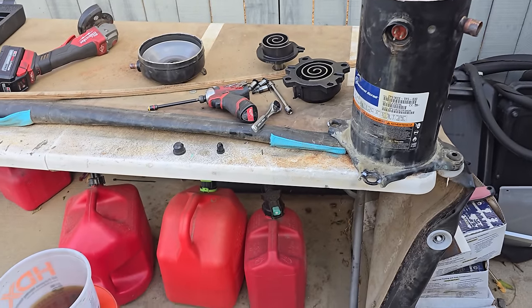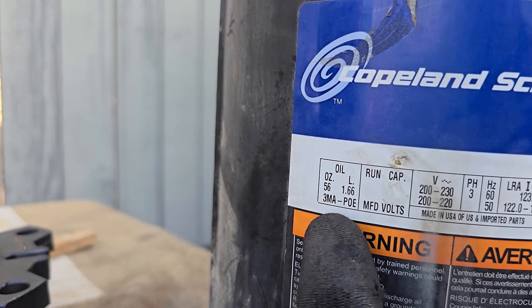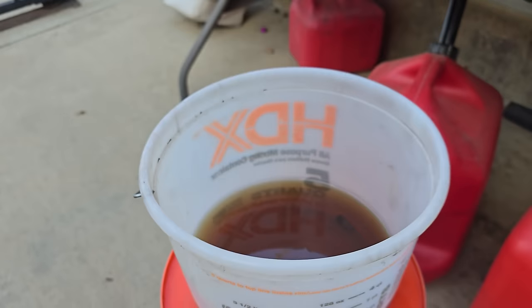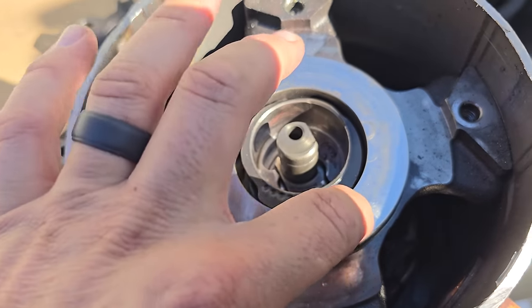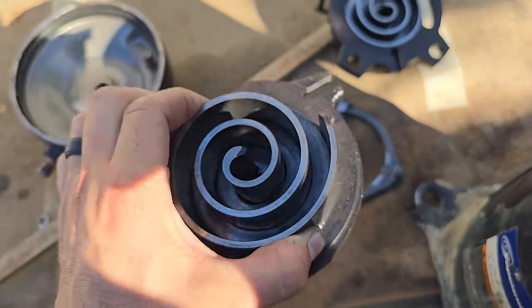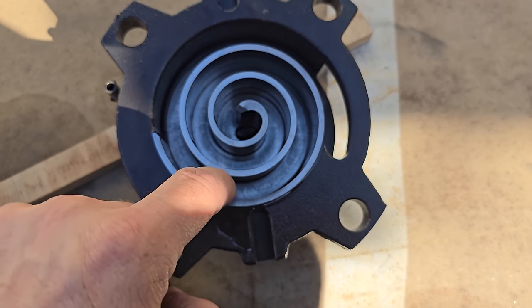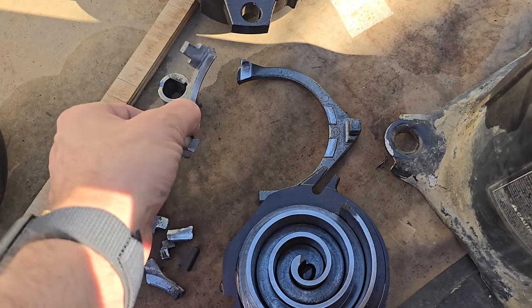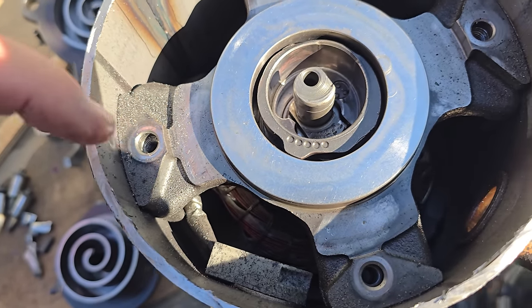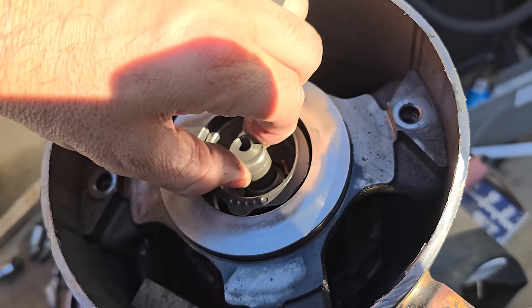I don't advise taking a grinder and cutting and shooting sparks when you have gas cans around — of course, I've moved them out of the way. Let's look at this oil charge: 56 ounces, pretty darn close. There's probably still a little bit of oil in there, but I don't think oil was the problem. Looking up inside here, not too much going on — there's some galling, you can kind of see the little round knobs. Looking in there, there's a little bit of galling, nothing horrible. This is the fixed scroll with a little bit of galling — you can see what look like tooling marks. But the real thing is this Oldham coupling right here — it was broken, and these little pieces were all down in the windings. That is more than likely what shorted out — these pieces going down in there, touching the windings, vibrating, probably getting stuck in there and causing issues.